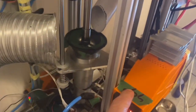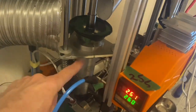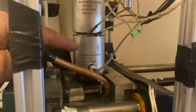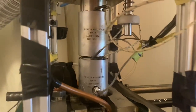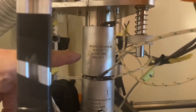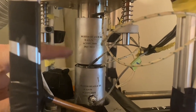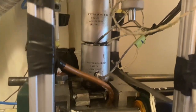I have a PID controller here and another one up here running the two temperature zones. Some people only run the lower zone and disconnect the top one, just running the bottom at 260 with the top off — that does work too. I wanted to maximize my heat as much as I can get away with. I could run the upper zone up to about 150–155 degrees, but for this particular part I found 130 is best, with 260 on the lower — it takes a bit of tinkering.